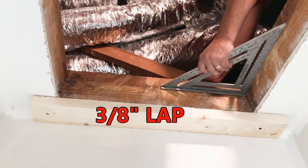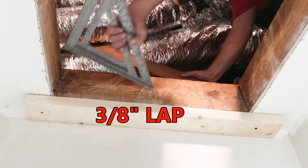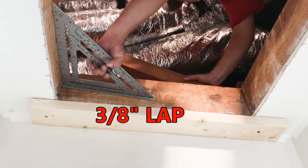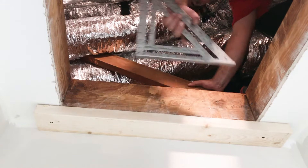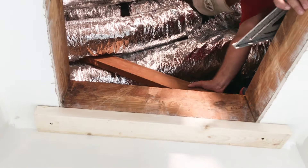Mike's going to set the 12 inch square up there. You can use a framing square but this works. 12 inches shows it really well and you can see this is perfectly square on the back side. That's where your hinge goes — that's the most important part.